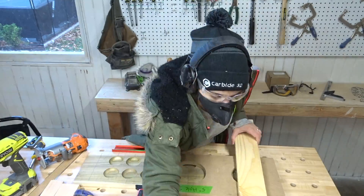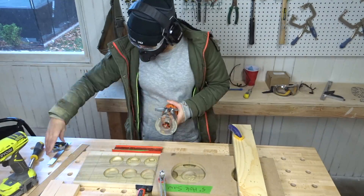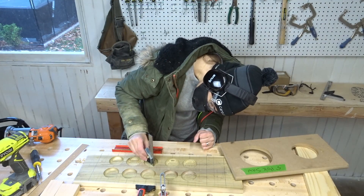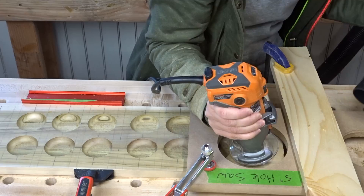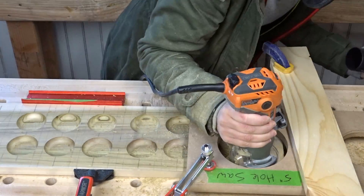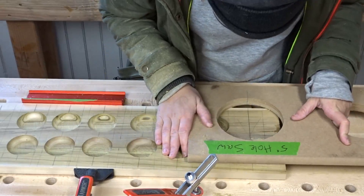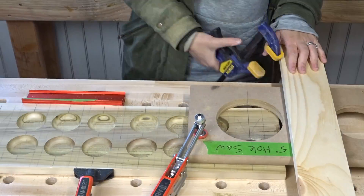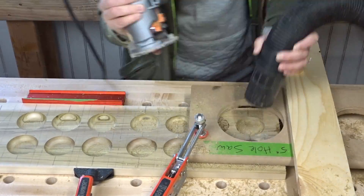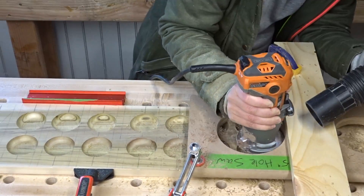So if you can spot the unintended irony in this little clip here, comment below. The main 12 holes are basically very repetitive and I just kept measuring to see that they were all the same depth. Now the home holes — the big ovals on opposite sides of the board — were a little different. I had to connect two holes from either side. First I used the router to make the two opposite holes, then I moved the template to the center and used my router to route out that middle part.